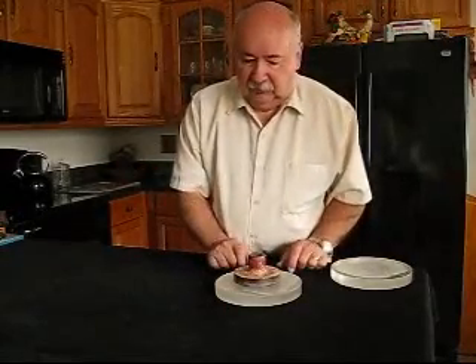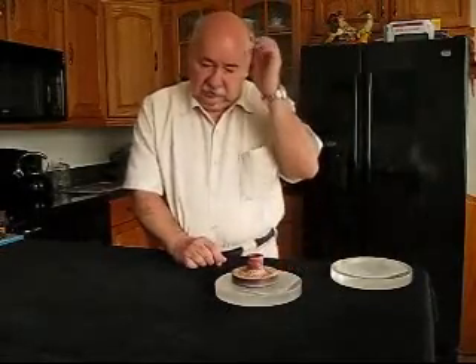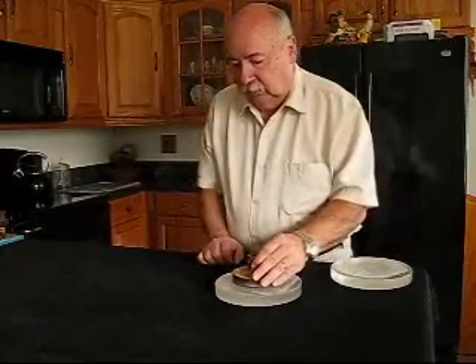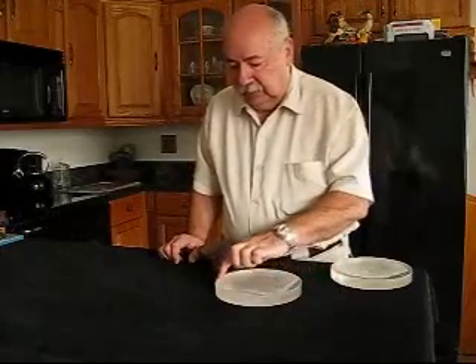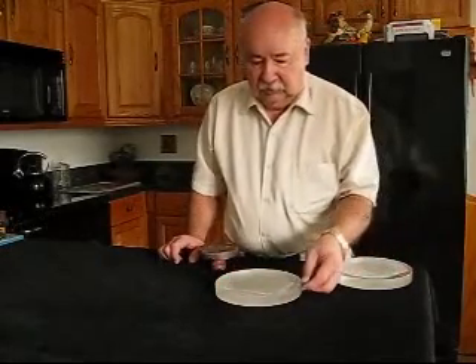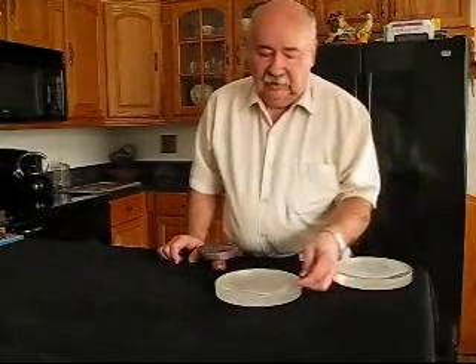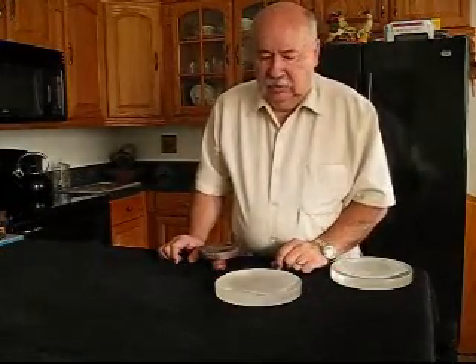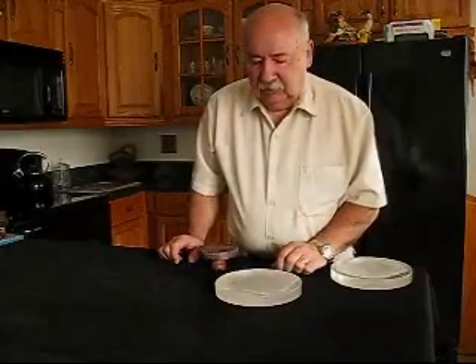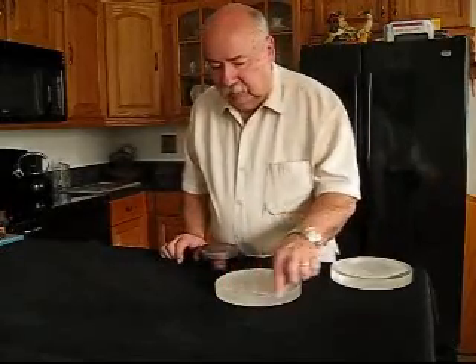You can do it on the machine if you can. And as you're doing it, you want to be able to measure the curve. I should back up — before you do anything to a piece of glass, you want to make sure you take a stone and grind a nice protective chamfer around all your edges, because a sharp edge on a piece of glass will chip very easily. And you can easily make a nice big chip across your mirror. It would still work, but cosmetically it looks really bad. So the very first thing you want to do is take a stone and chamfer the edges of your glass.